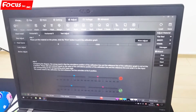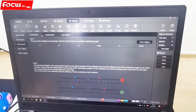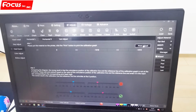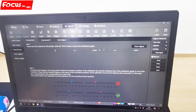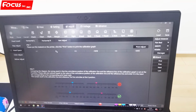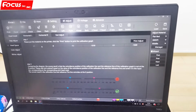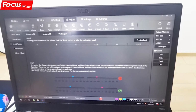The first we go to choose the horizontal, check horizontal, left, right, vertical calibration. Because by this way we print the adjustment, it's hard to see the lines because the white ink lines weigh more. So the best way is we print a picture. And always the H1 print head is 0. You cannot change. Keep H1 print head as 0. We change print head position by H2 and H3. H1 is color, H2 is white, H3 is varnish. Like this. So we forget it first.